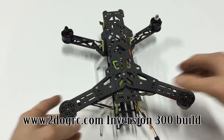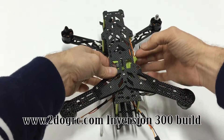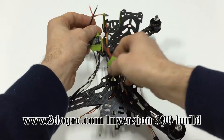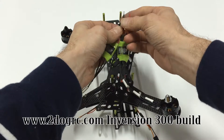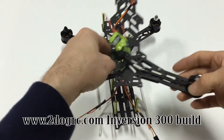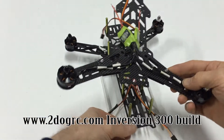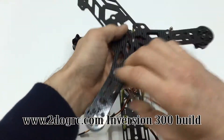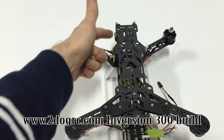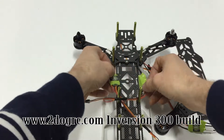I've figured out my layout. What I think I'm going to do with the speed controllers is take the top two and wire their power wires together - the red and blacks together - and then connect that to a connector off the power distribution board. That way if I need to pull the top off, I just disconnect it there, which makes it easy to work on the insides. The video transmitter is going to go right here, the camera up front, and we're going to mount a GoPro-type camera up here, with the flight controller right here.